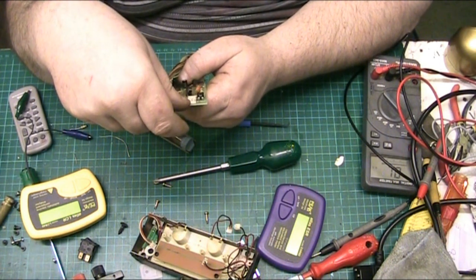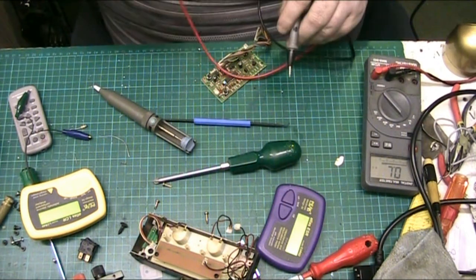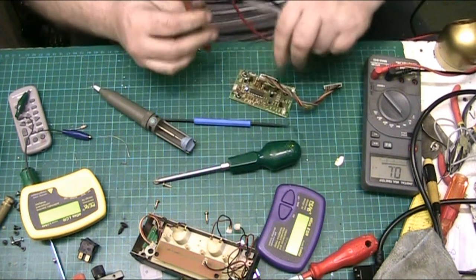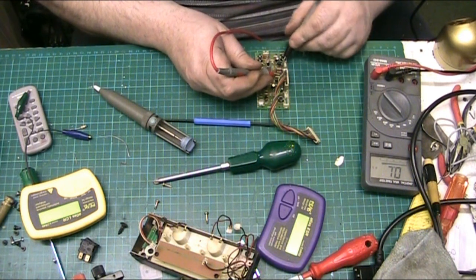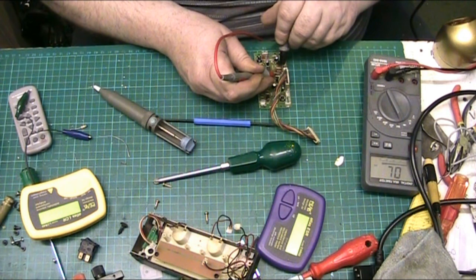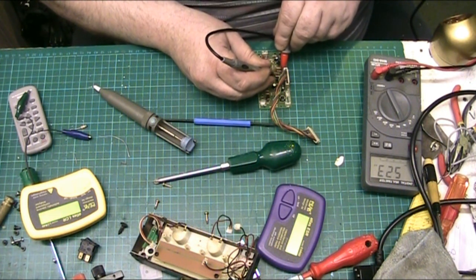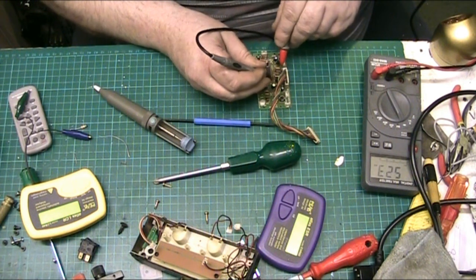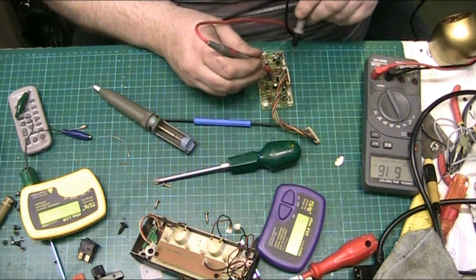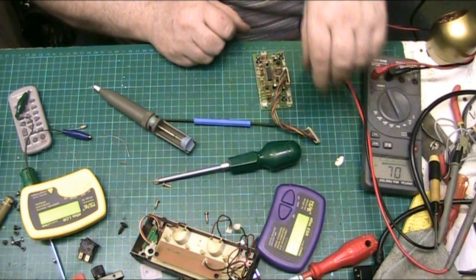R680. Right. Yeah, just make sure none of these diodes are blown. But it's actually the resistor that's killed, that's died. And that's probably why the fan didn't come on, because the fan was all jammed up, but, you know. Just test this diode here. See if we're open. No, we're okay. Test this other one outside of it. We're okay there. We're okay there. Just that resistor. That resistor's got a bit too hot, so I need to find out.